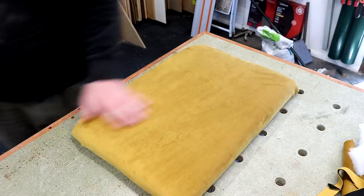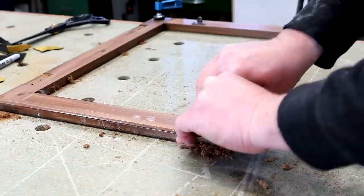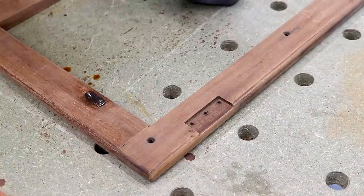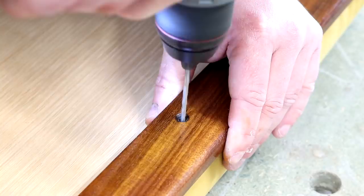I'm not great at this upholstery stuff to be honest but it turned out good enough for me. The wooden frame can then be secured to the plywood to hide the upholstery, but before I do that I'm going to clean up the wood. For that I use some good quality 100 grit abrasive paper, a card scraper or cabinet scraper, and my two carbide scrapers. I do most of this work with the card scraper usually. Then I do a bit of sanding and apply a coat of shellac to help seal the wood and pop the grain. I drilled some pilot holes and then secured the frame in place again with the original screws.